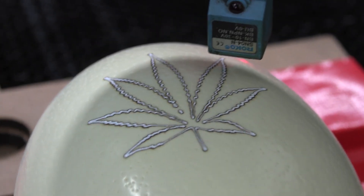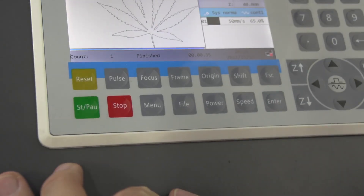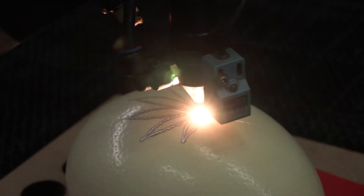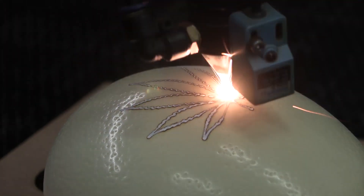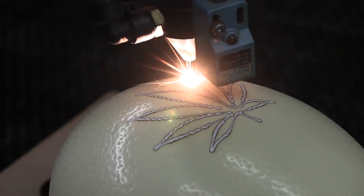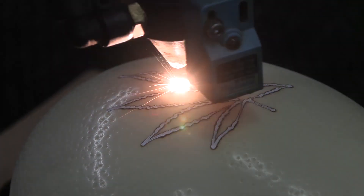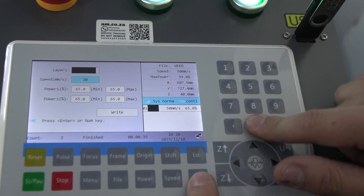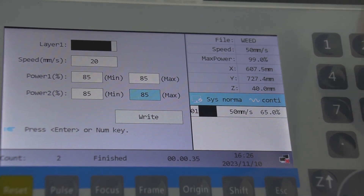After the first try, it didn't cut through, so we're going to do it again. I've gone ahead with 45% power and 50% cutting speed, purely because I think an egg is quite brittle. A concern of mine is that if I have the power too strong — thinking of a normal egg — it shouldn't be too thick. If I go through the first cut and it has too much power, because it's unfocused from the top to the other side of the egg, it might burn it. On the second time it still hasn't cut through, so I'm going to up my power settings to around 80% power and keep going until we get all the way through.